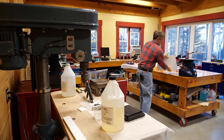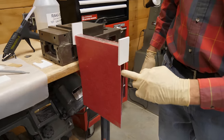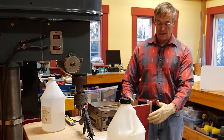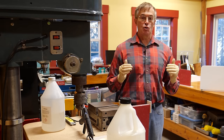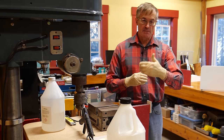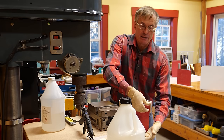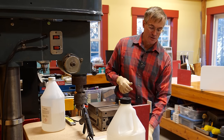You'll notice that I've left this open — and clearly you don't want that. You need to somehow close that in. The trick to being able to close this in and form a very strong panel is to take advantage of the fact that a panel's stiffness is proportional to the cube of its dimensions. So we can frame the panel by putting some structural material around the edges, reducing its unsupported area — even a little bit will make this far, far stronger.